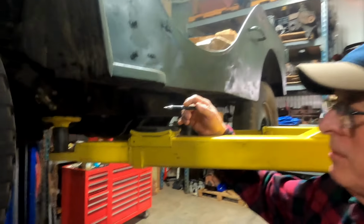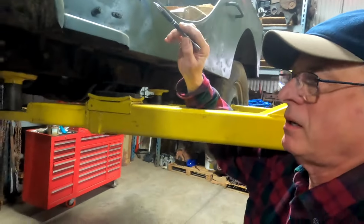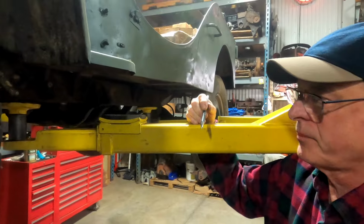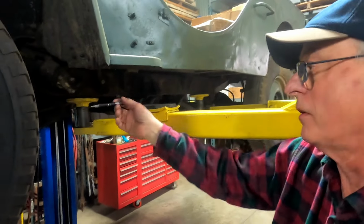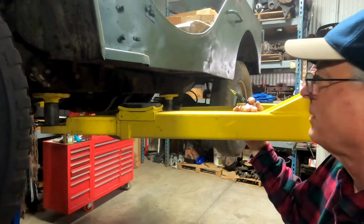It's got a Model A transmission mated to that. It's a 9N tractor engine, but they tried to boost the compression, so it's got a higher compression head, a little more piston in it, and a camshaft with a little more duration. They're all stamped GP. The tractor engine had a cast oil pan, but this skid plate oil pan is stamped and is for the GP. They had to make a cutout in it so that the drive shaft would go through. The drive shafts on these are on the left side, whereas Willys' were all on the right side. I can't remember whether Bantam's on the left side. Bantam might be on the left side.